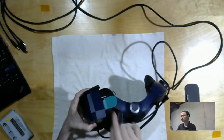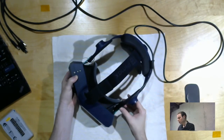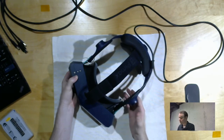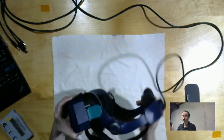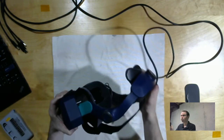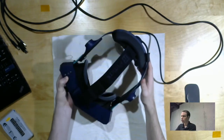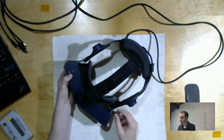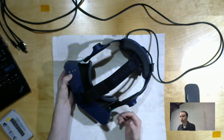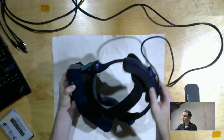Okay, 3D printed hinges applied. These are the new hinges in green. They're printed at hips, so they're a little weak, so it's just an experiment, but they did print the first time successfully, despite needing some support material. And they still don't go quite as low as I want, but they are an improvement. These are the hinges that are based on the plastic hinges with no additional modification to the angle that the stop limiter mechanism is set to. I have a whole batch of additional hinges which do have adjustments to the stop mechanism, so we'll see.